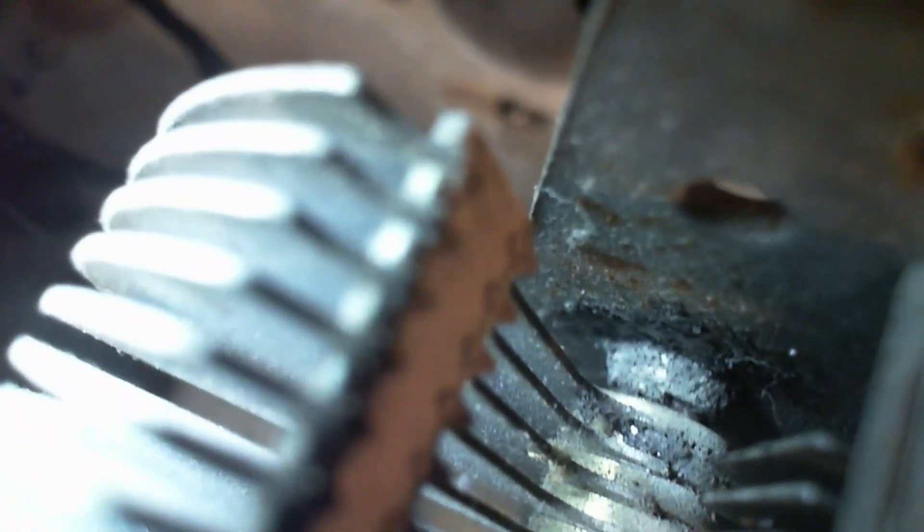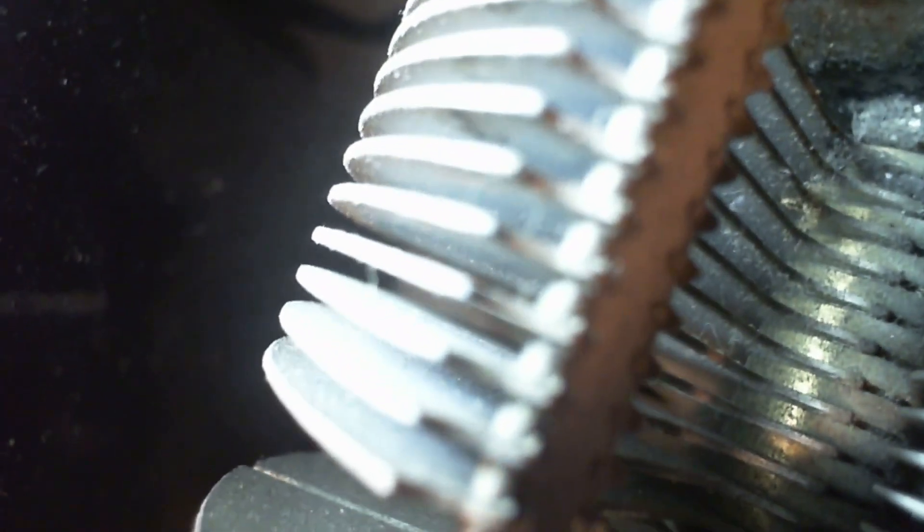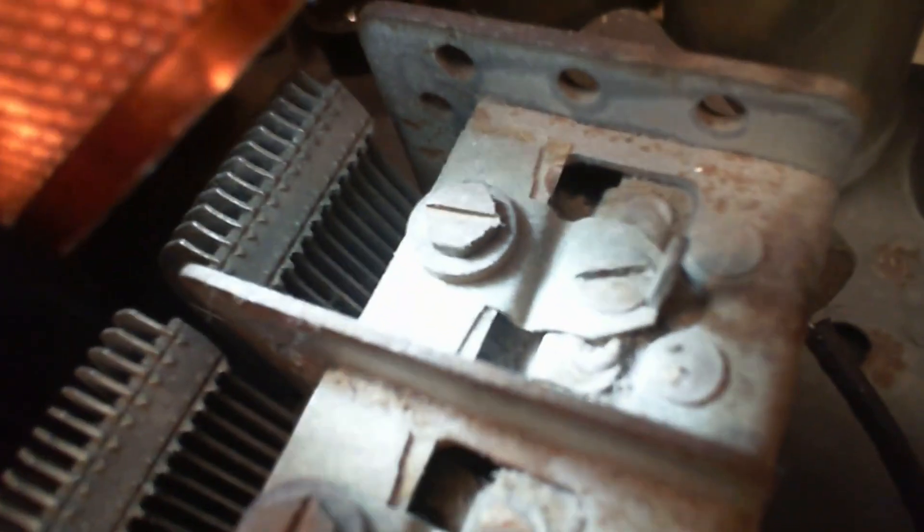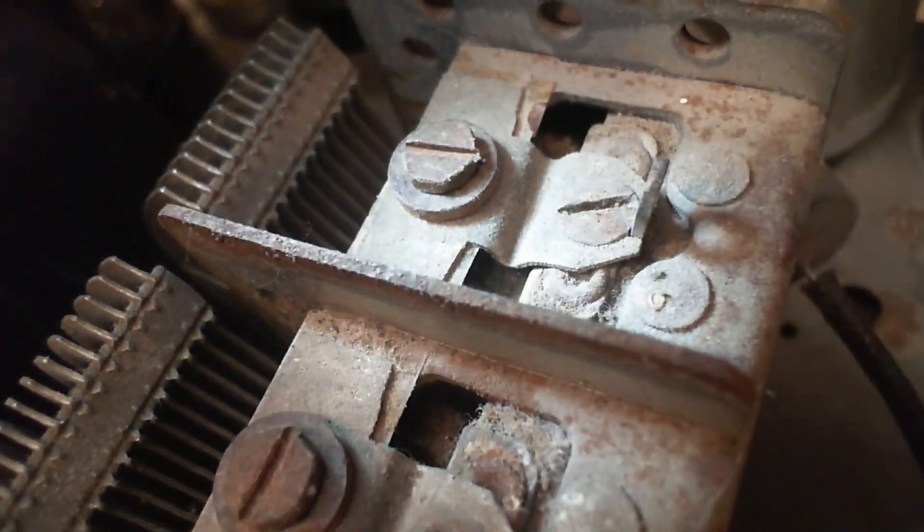Just another bearing — not a ball bearing this time. This outside bearing is actually adjustable usually. See that screw there — you can adjust the tightness of it, and that will cause a shifting of the plates a little bit relative to each other, the rotating plates and the stator plates. Look at the dirt down in there. Wow, that looks kind of ugly. So we want to lubricate those areas. There's a capacitor here that's going to be for doing the alignment, also very dirty. Really rusty — it's a very rusty radio.